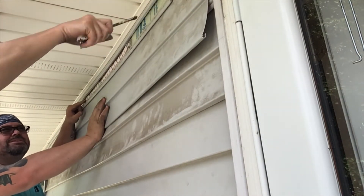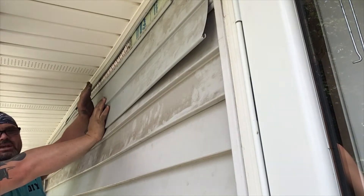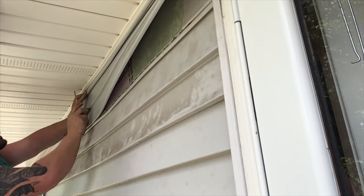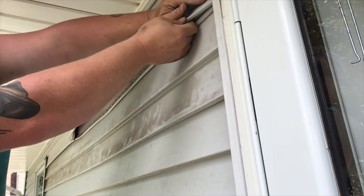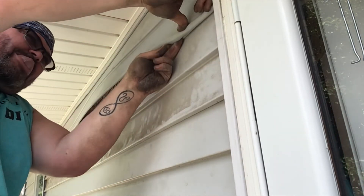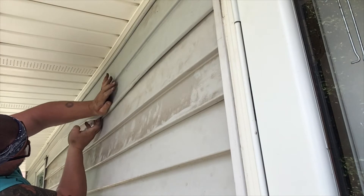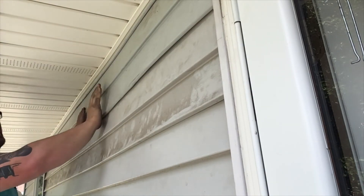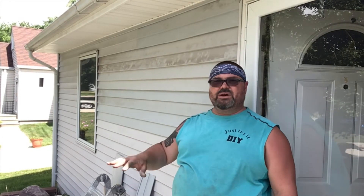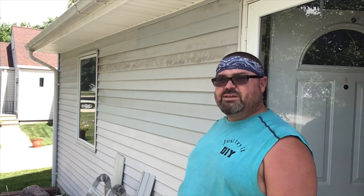The old nails are still up in there from the old stuff. So what we're going to do is actually trim off the nail flange at the top in order for this to go in, because we're hitting the existing nails that are there. We got everything all patched back in over that old window. We had a little complications - two different kinds of siding, different colors, and it had a little bit of fade to it. But we had some dirty ones, we'll get it all cleaned up and it should match in pretty good. Got rid of that window and we're back to good.